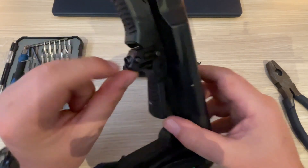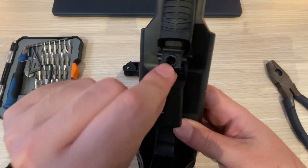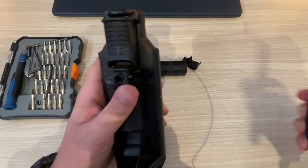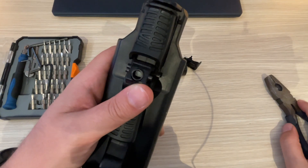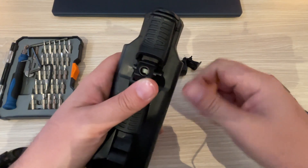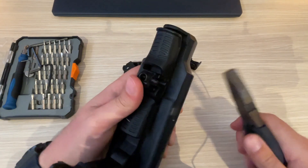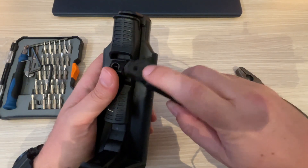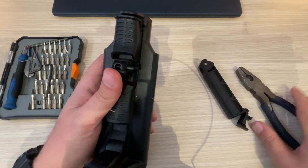This particular pin has a cutout on the inside for the spring to rest inside, so the spring kind of captivates the pin so it doesn't go from side to side. What you need to do is rotate it 180 degrees. You can see there's a flat spot on the inside — that flat spot must face towards you. Then use your pliers and slowly wiggle that pin out. It might be a bit tricky because there's not a lot of clearance between that pin and the surface.